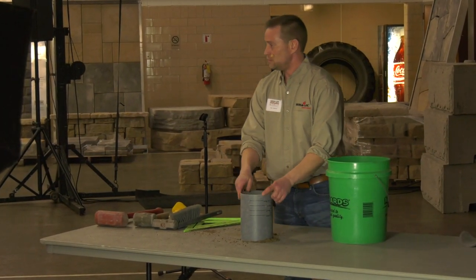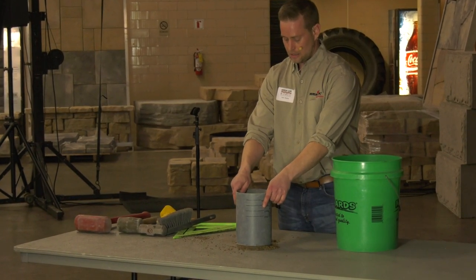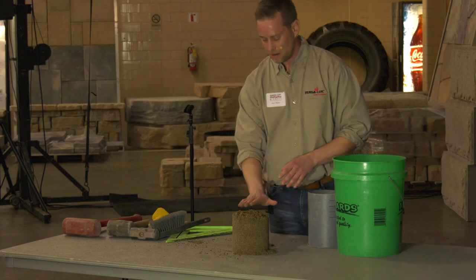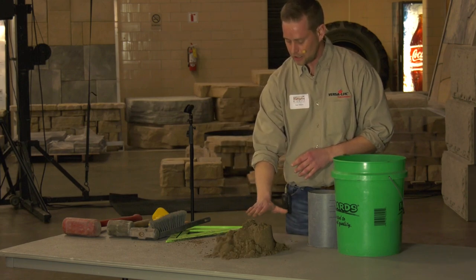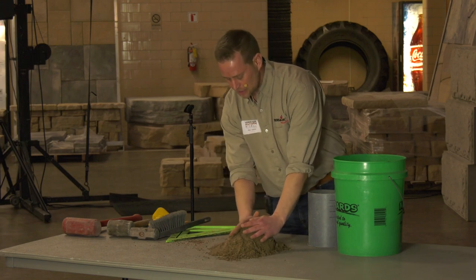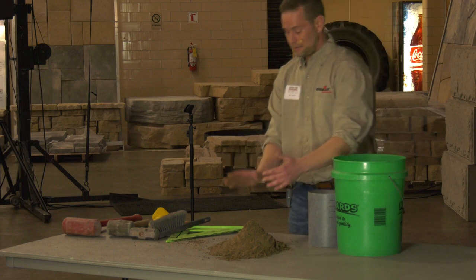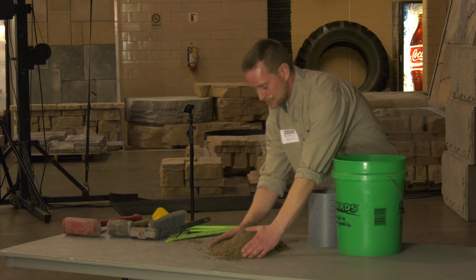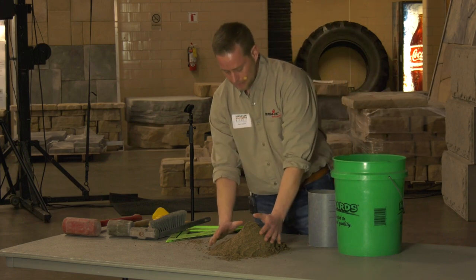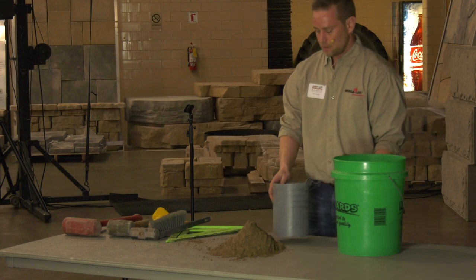As you can imagine, when we take away the outside form here, we're going to lose most of the structural integrity. This is so wet that it's holding together, but all we have to do is put a tiny load on that and we'll see this stuff slump off. If the sand was a little drier, we would see the sand slump off in the phi angle — we would see that angle denoted here on the side, but it's wet enough where it's got more of its own composure.